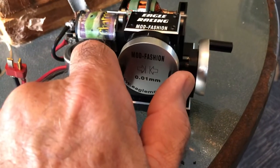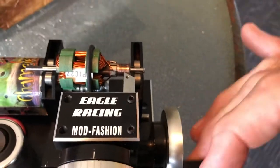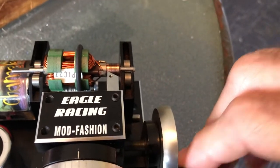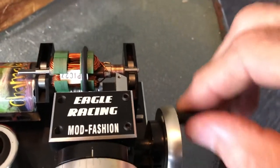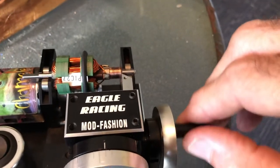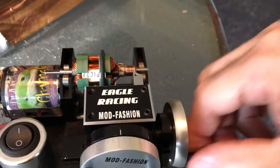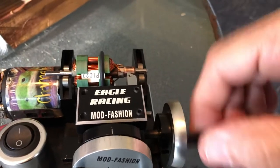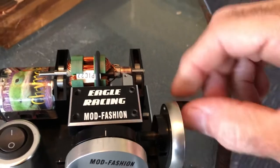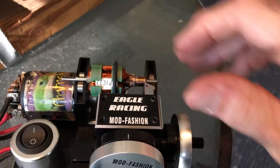You just move it in slow tiny increments. This knob over here allows you to move the blade to the left towards the windings of the armature — that's where you stop. Then you come back; that would be one pass. Then here's your second pass, coming back to the end of the comm. When you come back to the end of the comm, adjust, bring it back all the way to where you're stopping, then come back — that would be two. Now we're going on three passes, and you keep doing this until you have a brand new resurfaced commutator.